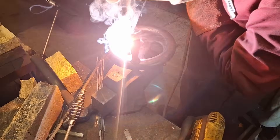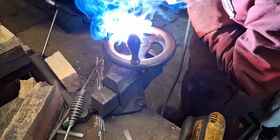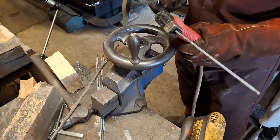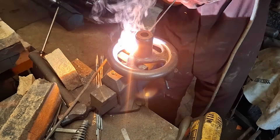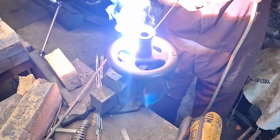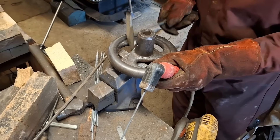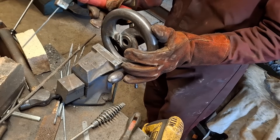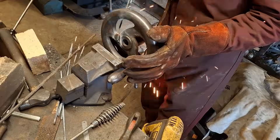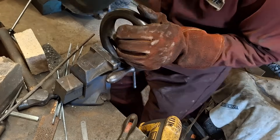A.C. Davies explains this very well in his book 'The Science and Practice of Welding,' and I quote: 'Cast iron is a comparatively poor conductor of heat compared with copper. If we heat the casting in one spot, heat will only be transferred away very slowly; the part being heated thus expands more quickly than the surrounding part, and since expansion is irregular, great forces are set up. Since cast iron is brittle and has very small elasticity, the casting fractures. The welding of cast iron is thus a study of expansion and contraction and conduction of heat, and to weld cast iron successfully great care must be taken that the temperature of the whole casting is raised and lowered equally throughout its mass.' I ran a root bead around this spoke and then a capping bead over the top. Between the passes, the part was placed back in the furnace for a five-minute soak on a low flame — this equalizes and maintains the temperature across the part.